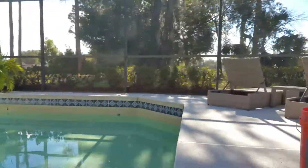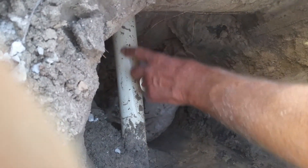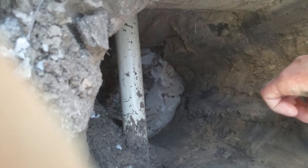What we'll do is go ahead and cut the pipe here, remove this section of pipe out of the wall, and put a new female adapter on the end of it so the new eyeball fitting can screw in and couple the pipe back together. We may decide to use a piece of flex pipe here — we haven't decided yet how much variance there's going to be in where we cut the pipe.